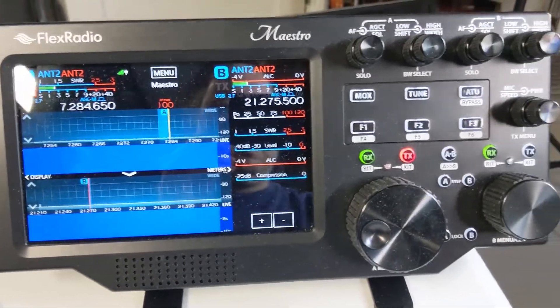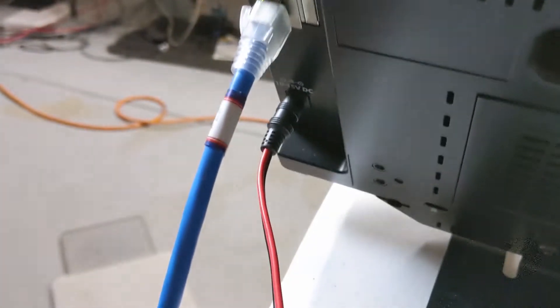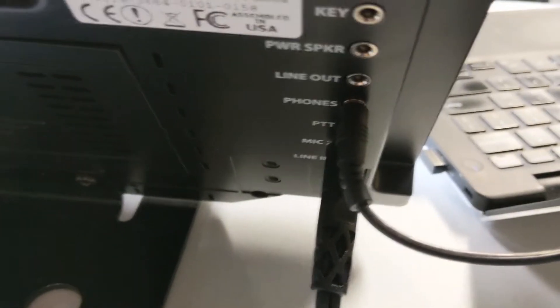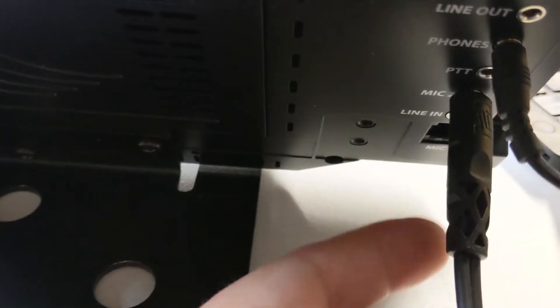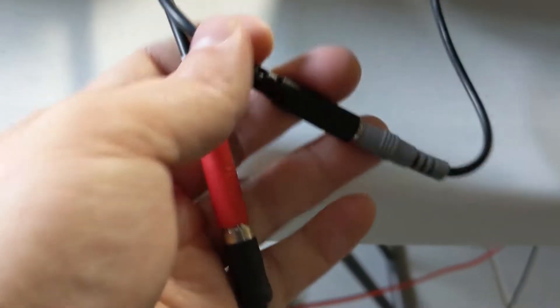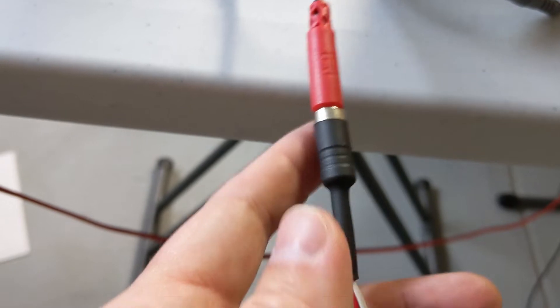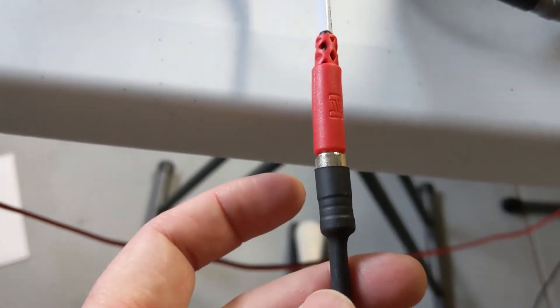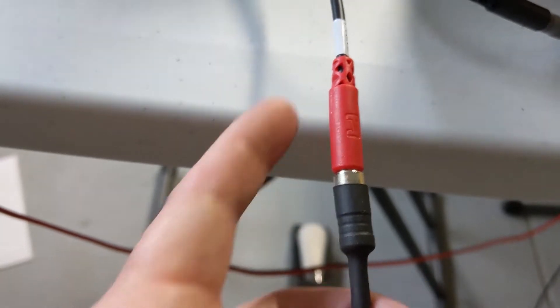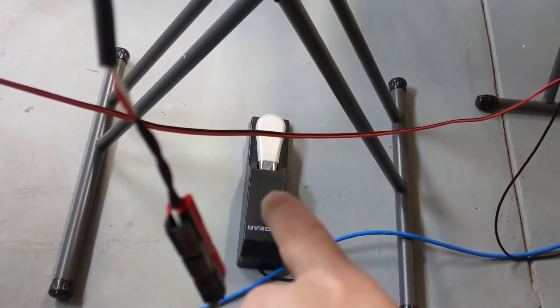Here's my Maestro, connected in through the network. Power. I've got my headphones and my mic — this is a stereo plug that gets connected out to two jacks; this one is the mic input. And here is my push-to-talk. It's a TS tip-sleeve connector that comes into this adapter and then to an Anderson Power Pole, and eventually goes to my push-to-talk switch.